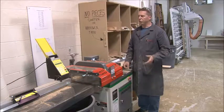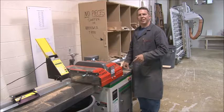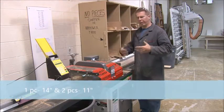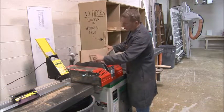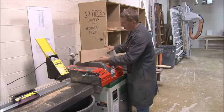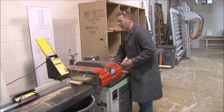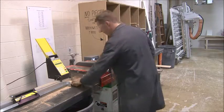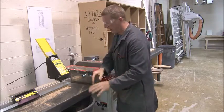To make the stiles and rails we need to start over again and do rough cuts. Your dimensions are lengths 14 and 11, so I'm going to need one piece at 14 and two pieces at 11. Get your board out and check it for defects. This one has a crack all the way down, so I'm going to cut off quite a bit to get rid of it. Throw the offcut away — nobody wants a crack in their board.